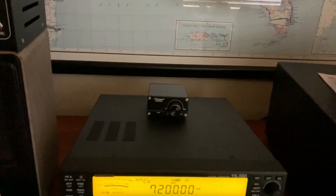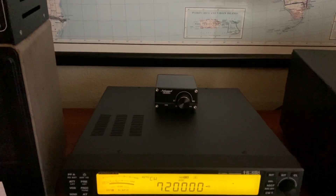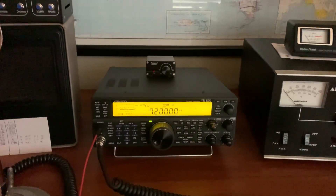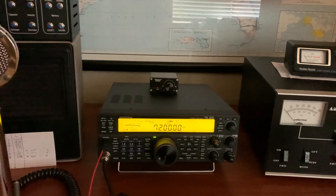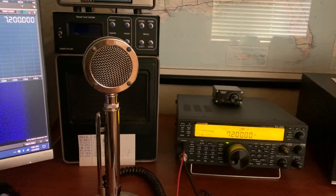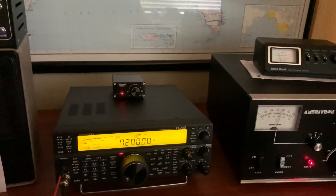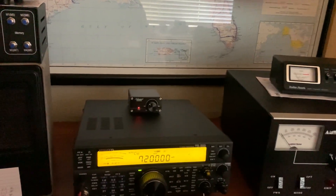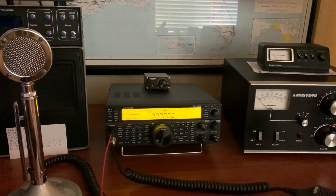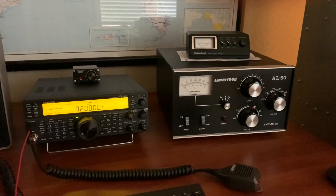What I might wind up doing is making a little small relay box so when I transmit it basically disconnects this audio amp, because it's being driven from the 10K output in the back of the 590SG. I'll check next to see if the D104 is still getting RF into it on dummy load. I probably should have started on dummy load first, but I had a perfect visual and there wasn't much activity on 40, so I found a quiet spot and was doing it. I'm tuned up on 40 meters.